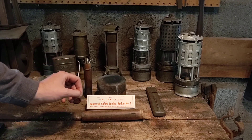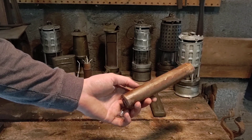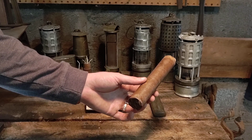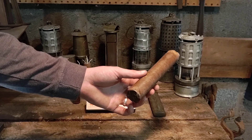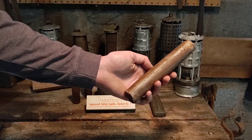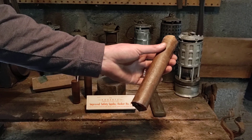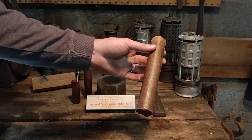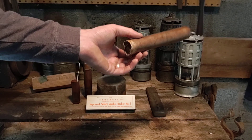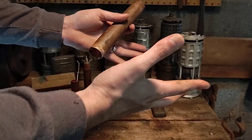For our black powder charge, we're not going to take loose black powder and try to cram it back in the hole — what you would do is make one of these: a cartridge. In later years these could be bought, but usually they were prepared by the miner or by his wife at home. This one is brown paper dipped in wax to make it waterproof. It would be filled with black powder and folded over. The miner would take all his charges in with him for the day. When the needle was inserted it would puncture a hole in the front of the charge, and then the rocket squib would make contact with it and this would explode.